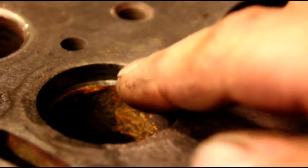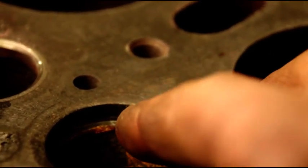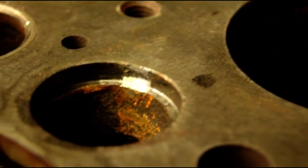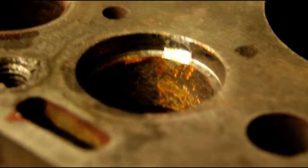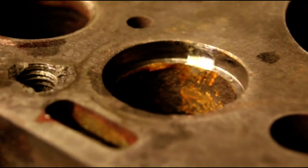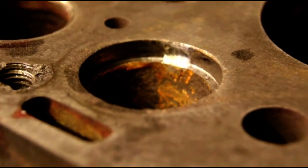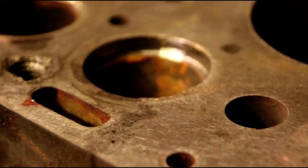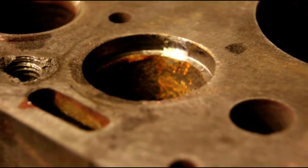There's a seat all milled. This is our stitching pin, and that seat cutter cut a perfectly flat bottom — we just started removing rust around the whole thing. That is what a seat cutting tool looks like. The exhaust seat cutter is one inch 562 — that's one and nine-sixteenths, a standard size. There's no mystery on these old engines; it's a standard size you can easily get. I'll put a link below on where to get your seat cutters if you need them.